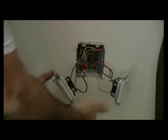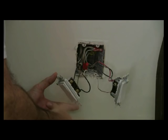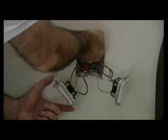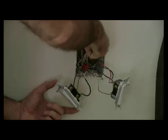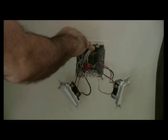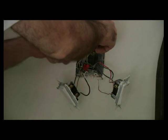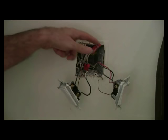What I have here is two black wires going through. Ordinarily, on any given switch, you would have a white wire and a black wire. But in this case, the original electrical work was done with two wires, so the white wires in the back are all tied together. What I've done is just take off the caps off these wires and do an inspection to make sure that all of the wiring is on there correctly and that they're tight. Once that's done, you go back in, twist that back really, really good, and then you're good to go.